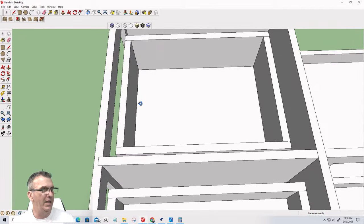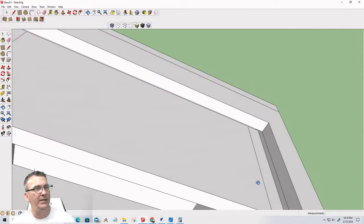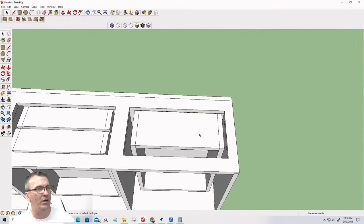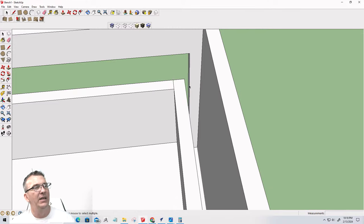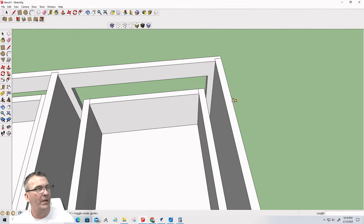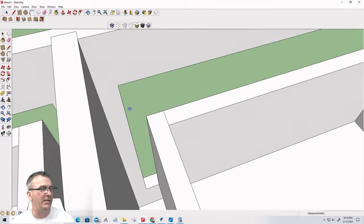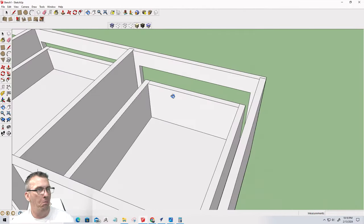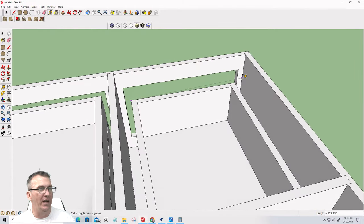All right, this cabinet technically should be centered already with my 1/16 from earlier today. And I can verify the measurement. Now, it's not going to be 1/16 on this because the outside boxes are slightly wider. But I should be able to measure here to here, 1 1/8. And I should be able to measure here to here, and that's 1.5. So I'm not centered. Yeah, I'm definitely not centered. Okie dokie. So if I'm 1 1/8 over here, 1 1/2 over here, that's a 3/8 inch difference, right?